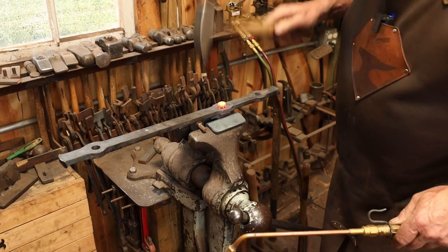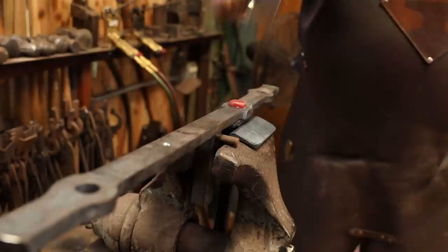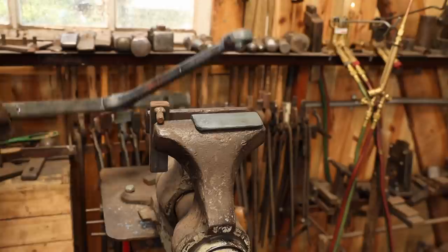This still ended up being kind of a pronounced rivet head, so if he doesn't want to have that there and have to recess it into the timber a little bit, I'll go ahead and grind it flush, but it would be stronger this way. By using these angle iron inserts, it kept me from gouging this cross arm too much, and that helps a lot.